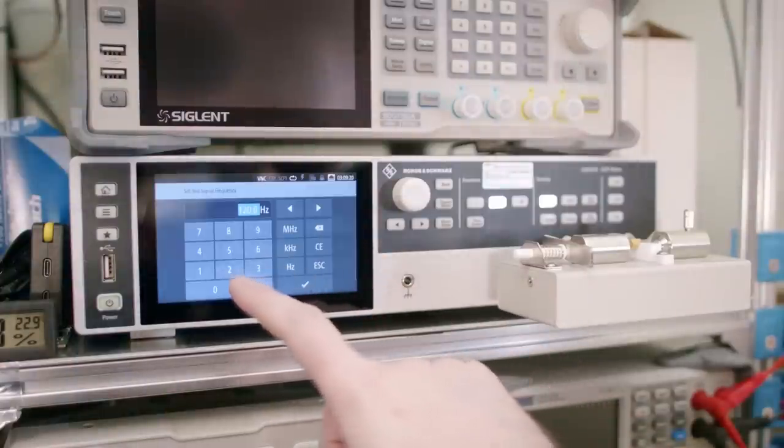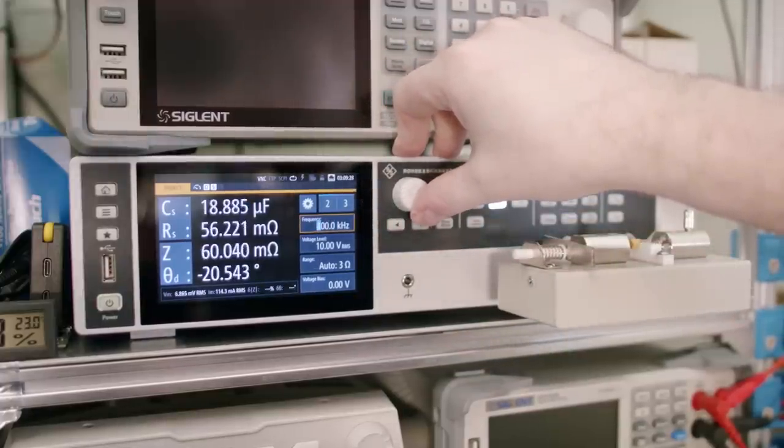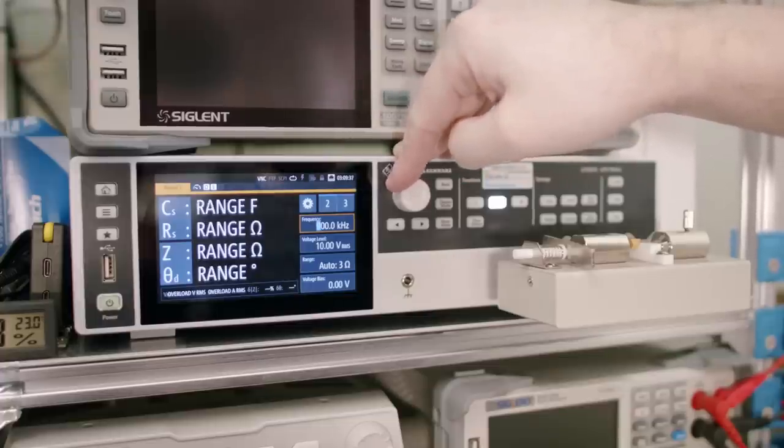On the other hand, the tantalum capacitor starts out strong for capacitance, though it has a similar ESR to the aluminium electrolytic. While the capacitance does drop off dramatically, it's holding out much better than the other capacitors until just past 800 kilohertz where it starts to get challenging for the LCR meter to figure out. As for ceramic capacitors, I'm going to ask you to subscribe and watch out for my next video, where I'll plot performance across capacitors from all major manufacturers with the same value and voltage rating, giving you the data you need to choose the best capacitor for your applications.